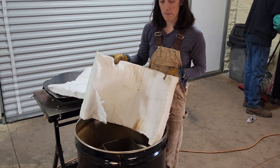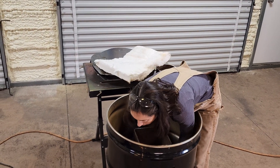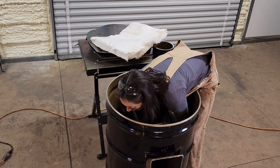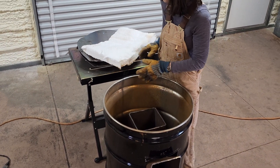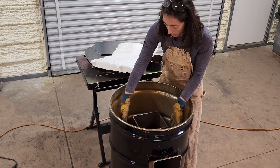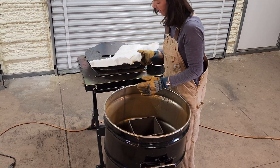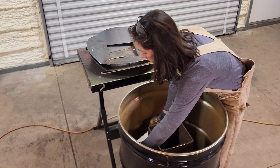I've got some ceramic kiln insulation that I'm going to use to insulate the firebox. You can get it in different size rolls, so you may need to cut your piece a little bit. We've cut ours to fit and have it wrapped around, and I'm going to go ahead and stuff this scrap piece in there too — it doesn't hurt to have a little extra insulation in there to protect the barrel.